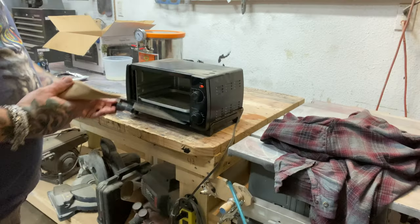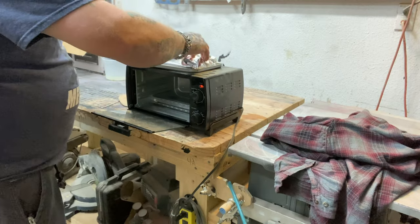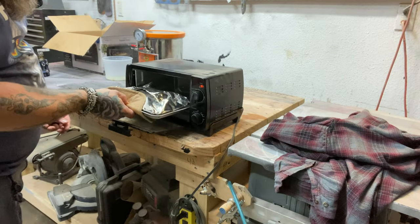The stabilizing resin actually fills in all those gaps. Stabilizing resin isn't like typical resins — it's a heat-cured resin. You have to use a little toaster oven or similar, put the material in, and it will bake and cure it.